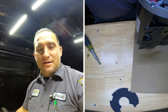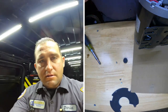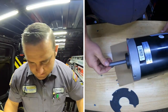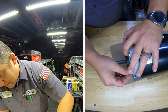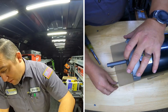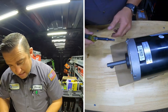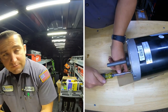Let's go ahead and put the cover plate back on. Some motors don't have that jumper setup, so this is very convenient. On startup of this facility — it's a brand new startup — all the motors were VFD capable but they weren't VFD rated, so they all failed. I believe this is the last VFD capable motor on there, but we'll find out. I thought we replaced them all, so it could just be bad bearings in the one that was in there.